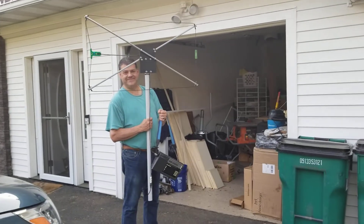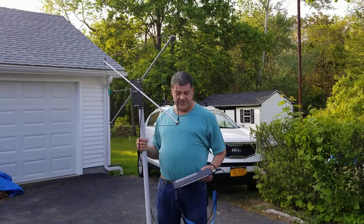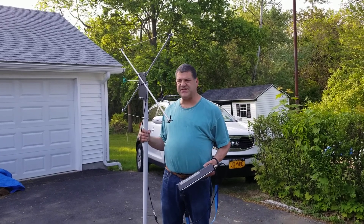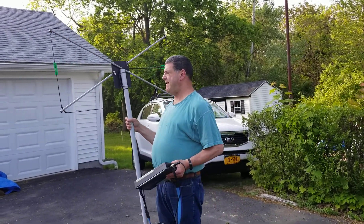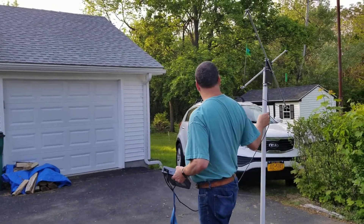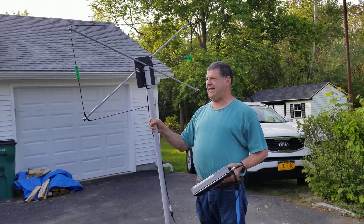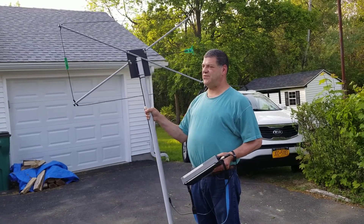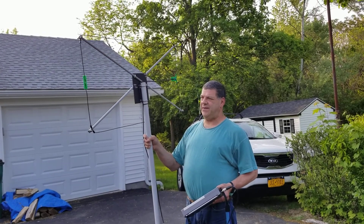So I have a pretty good idea that the garage door openers are what's causing it. Now I've tuned up to about 29 MHz. I also get some high-frequency interference, which I think is from another source — it does sound slightly different. In the middle of the driveway, it's very strong that way, and the null is unfortunately right towards the telephone pole where my electric and cable come in.